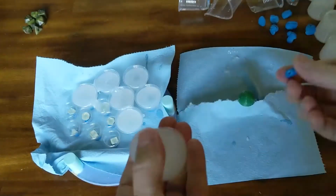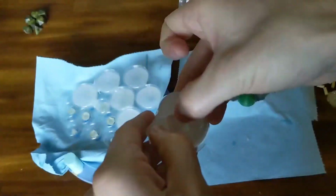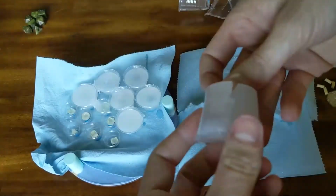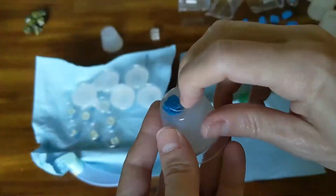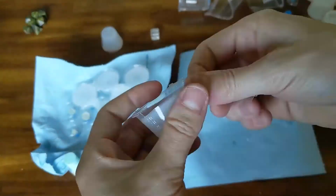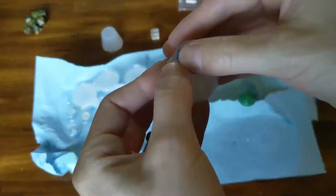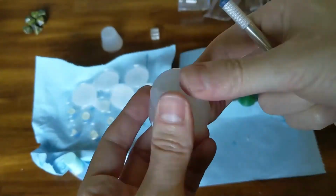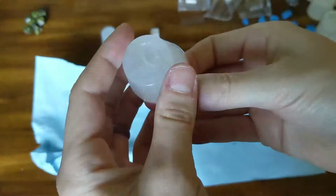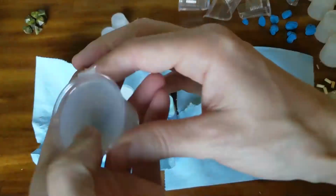With the other molds, what you normally do is just cut down halfway, like I've mentioned before. And you could use any other kind of silicone if you wanted to. Just make sure that you cut carefully, either along the edges. Some people cut along the edges if they can see them, which is why it's good to use clear silicone if you can. Others like to just cut down the face, just directly across, just as long as you avoid those numbers. The only problem is that's going to leave your seam of your resin, and that's what's going to be messy to clean up.